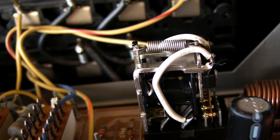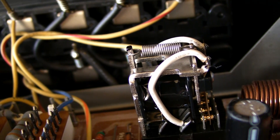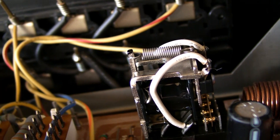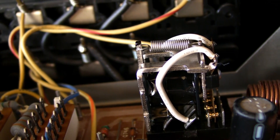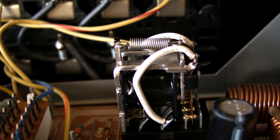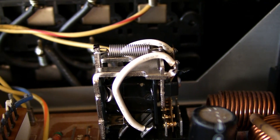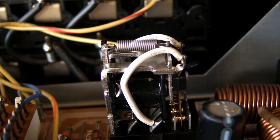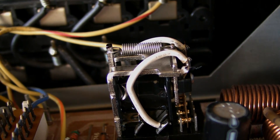I'm going to show you how to clean this thing. There are two things you can do if this thing is dirty. First, you can replace it - a relay will cost you about 12 to 15 euro. But if you're going to change this relay, you have to open it up from the back side, unsolder the old one, and put the new one in. Not everybody is that handy, because I think there are eight contact points you have to solder. So I'm going to show you how to clean this speaker relay in a very simple and easy way that everybody can do.